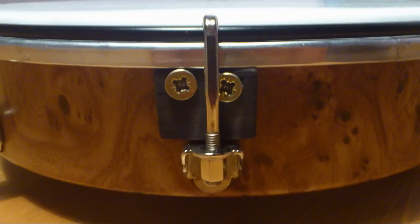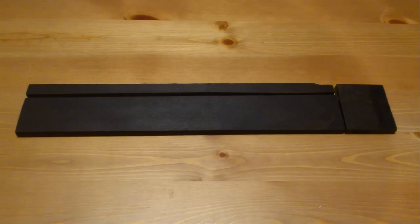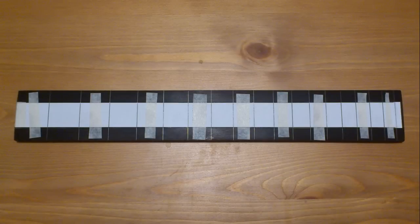With the neck prepared I could start with the fretboard, which is a very important part. I bought an ebony fretboard for mandolin and had to cut it a little because it was too large — it's really hard wood so it was quite hard. I used the spare parts for a tailpiece and to make a bridge. And here we get to measuring: the distance between frets matters a lot so it has to be as precise as possible. It's calculated according to the scale length — I used a calculator on the web, links are in description.